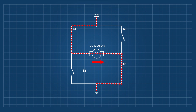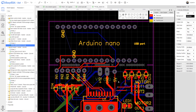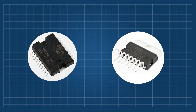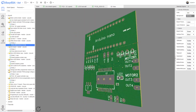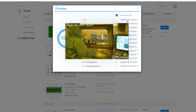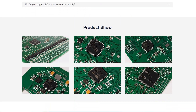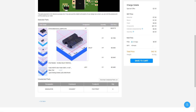The H-bridge is a very clever design using four MOSFET transistors. With that we can control the speed and direction of a DC motor. That's when I started designing a new circuit using the L298P instead of the L298N. Both chips work exactly the same but come in different packages — the L298P is smaller and is a surface-mounted device, while the L298N is a through-hole device. The design process took some time but with the help of schematics I found online I finished it without problems. Then it was time to order it from JLCPCB, which is also the sponsor of this video — one of the biggest names in the industry specializing in printed circuit boards. I ordered using their SMT service which provides and assembles the components, saving a lot of time and money.